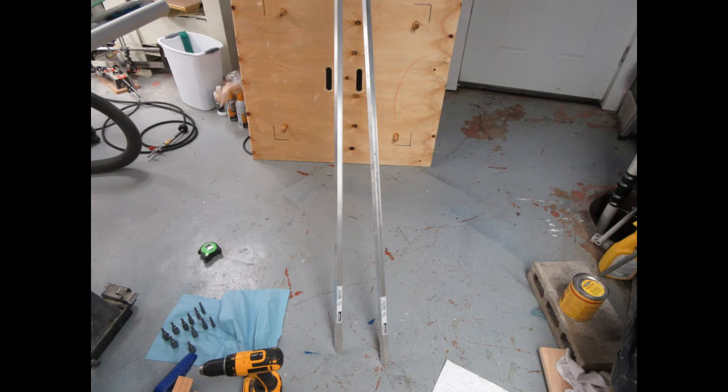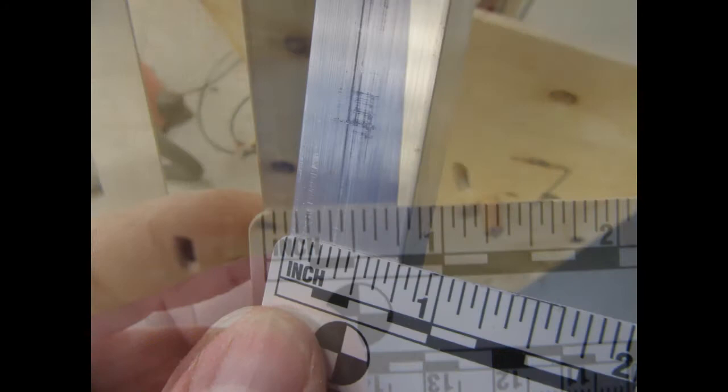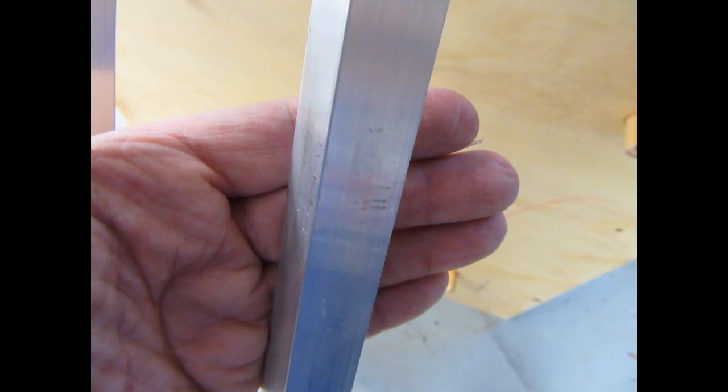To protect the edge of the three-quarter-inch plywood deck I decided to put aluminum angle all the way around. Luckily Home Depot had angle that was three-quarters of an inch on the inside of the L, so when laid over the edge it was exactly the right dimension. I wanted to do this for several reasons: cosmetically it looks nicer; I wouldn't have to treat the raw edges to prevent splintering; people carrying it around won't get splinters; and when the conductor steps on and off the platform, dragging a shoe over the edge won't damage the plywood at all.